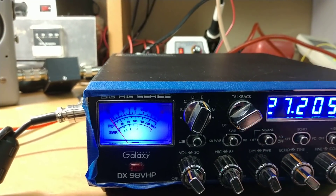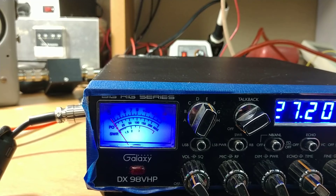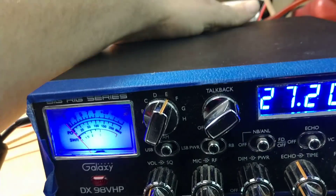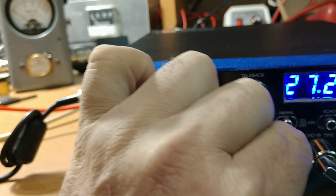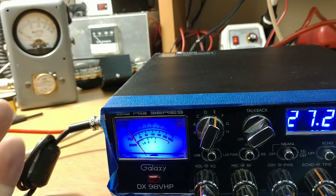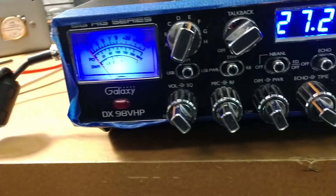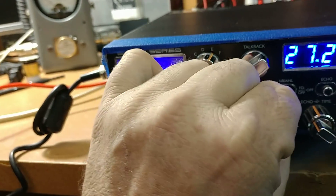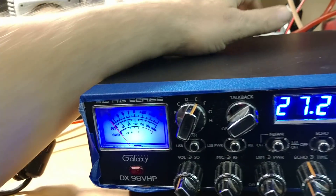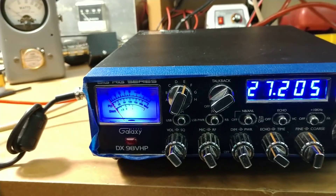So what you've got here on the variable power — I made this real simple for you, Squirrel. I know you're driving and you don't want to be fumbling with stuff. Kind of a set-it-and-forget-it type deal. So what I've done is whether you've got the amplifier off or on, it doesn't matter — you can run your RF power all the way wide open. With the amplifier off, you're going to do four watts modulating about 16–17 under tone. It does a little more under voice, but that's why we tune under tones — we've got a four-to-one under tone. When you turn the amp on, that four watts going to the amp is about an 80-watt carrier modulating about 325 to 350 somewhere around there. That's what the radio is doing.